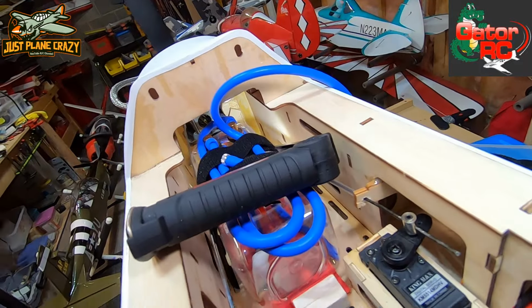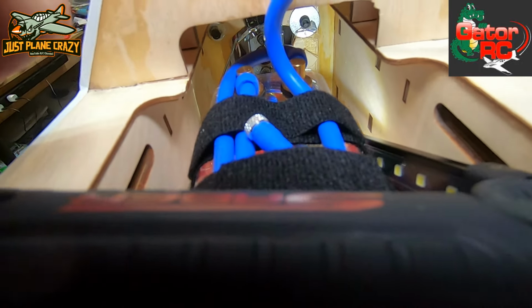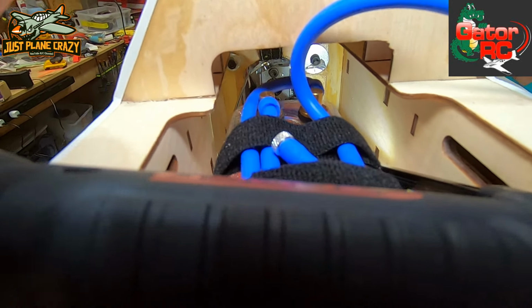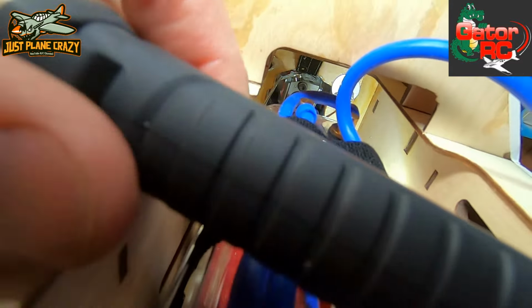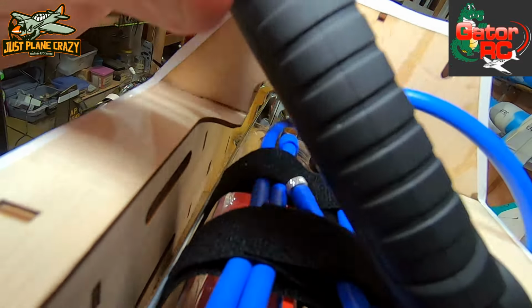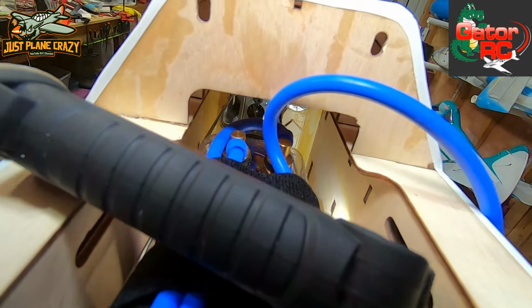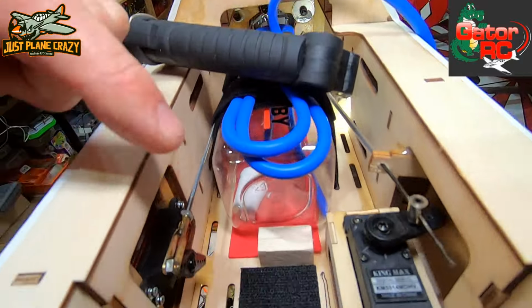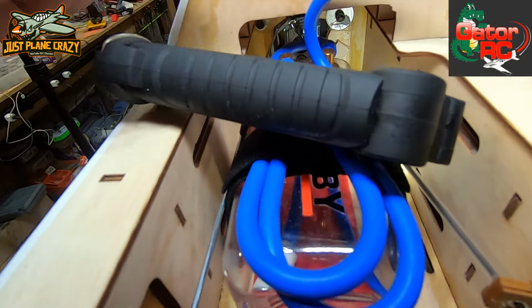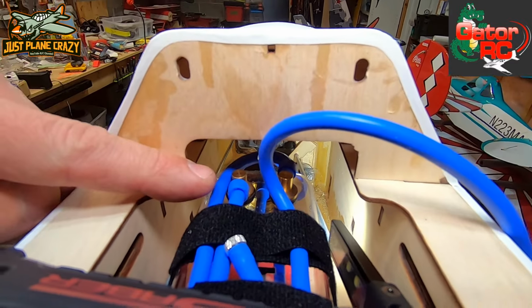It's time to choke it. Anyway, if you can see way up in the inside of there, that first plate you're going to see in the back of the carburetor, I hope you can see that way up in there, that's going to be our choke plate. Our choke plate is either open or closed. We don't run anywhere in between. We will set that up there.